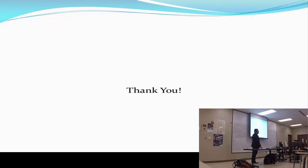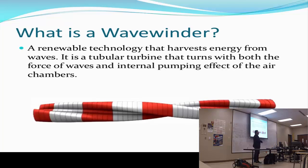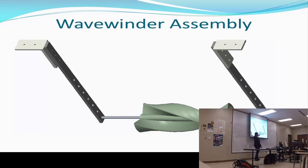David: Another question. The very first design, the very first one. Okay, this one. That operates on air pressure, you said? Well, it's supposed to, yeah, be pumping the air from one side to another when water comes in and it's rotating. Testing that? No, because this design that I have here is only half. It's too small, so water comes in and it barely comes out. So it's full of water, which makes it weigh more, and probably because of that and the friction with the shaft, it didn't turn well. So that's one of the reasons.